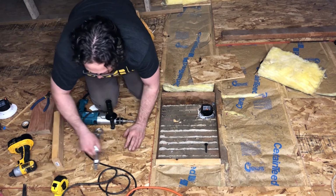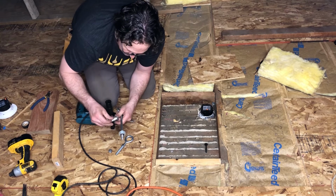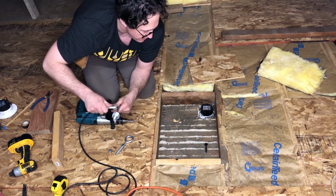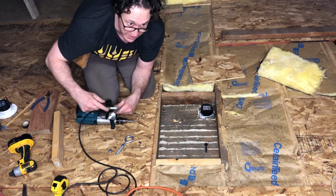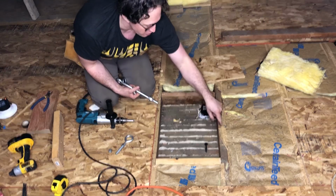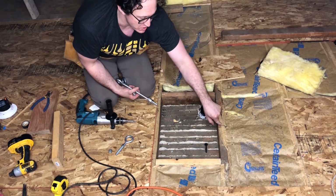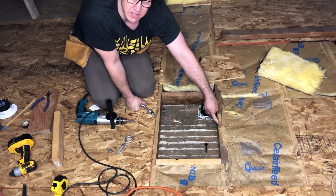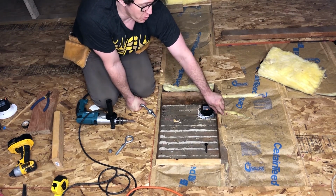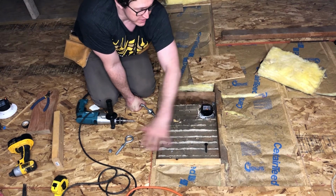So the reason it's best to do it from the attic is because you can bolt it from the other side and not just have it screwing in, right? Correct. Yeah. Okay. So typically, if you don't have access to your attic, your screw would just be coming right into one of these joists, and it'll be supported.